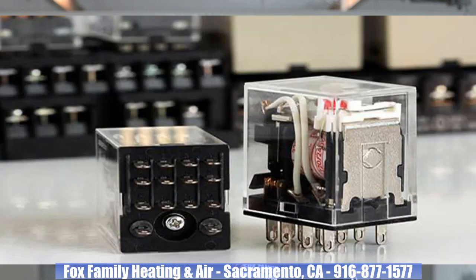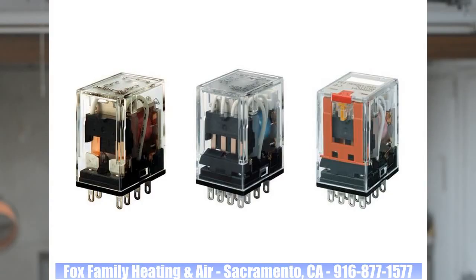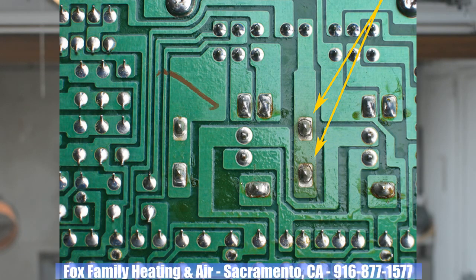Those old relays and controls, being larger than today's parts, were constructed with heavier materials. That's why they're more durable over time. The strength of the material used to build small control boards is obviously not going to be as durable as those bigger, heavier parts. You know the saying, they don't make them like they used to? Well, there is something to that. A static discharge 20 years ago would have been harmless to those controls. Today, that same discharge through the board can result in catastrophic damage.